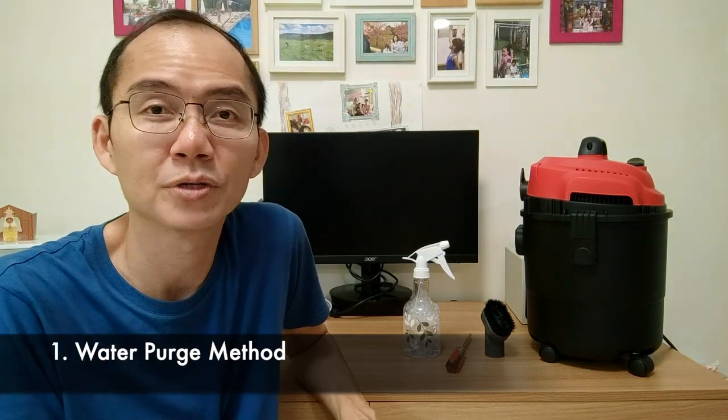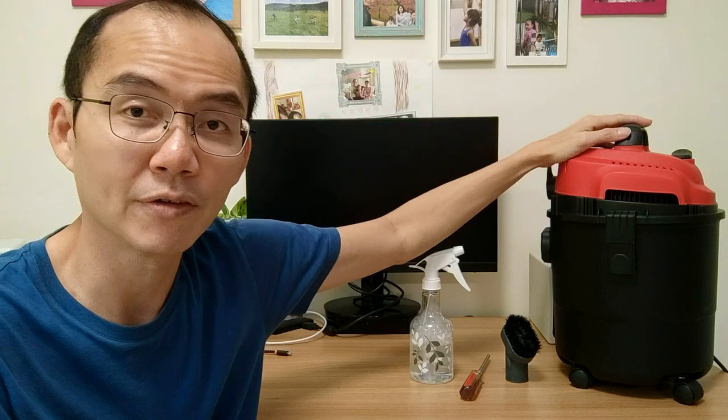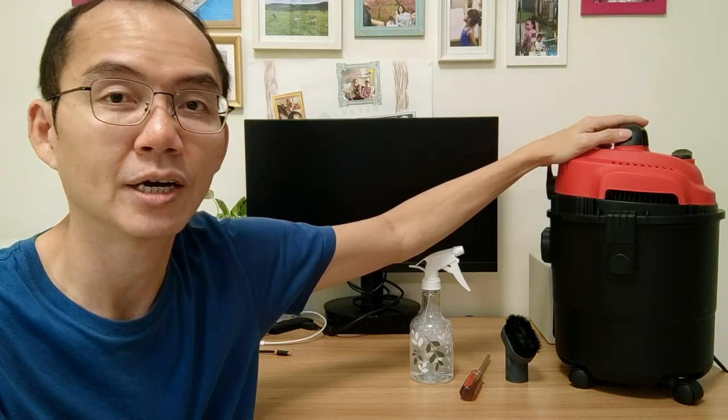Let's talk about cleaning out the dust. There are two common methods. Method one is to purge water — spray water through the gaps — but this is going to be messy, there's going to be a waterfall coming down the aircon, and we'll need a large plastic sheet to contain the water. We're not going to talk about that for now. Method two is to suck out the dust from the gaps. For this we need a vacuum cleaner — a wet vacuum cleaner that can handle water, because there's going to be lots of moisture in the gaps. The vacuum cleaner must be powerful enough for this to work. I'll do a review video for the vacuum cleaner and put a link in the description.